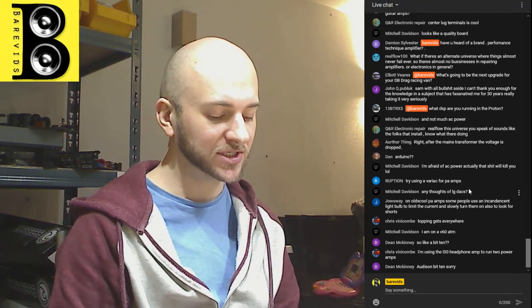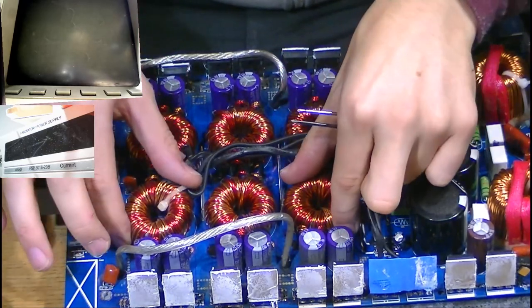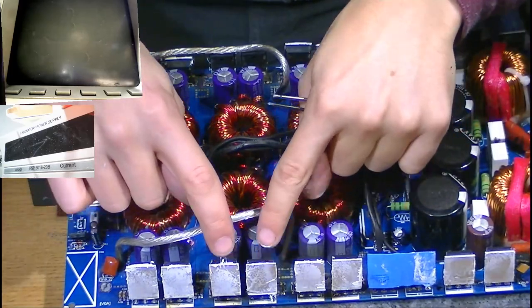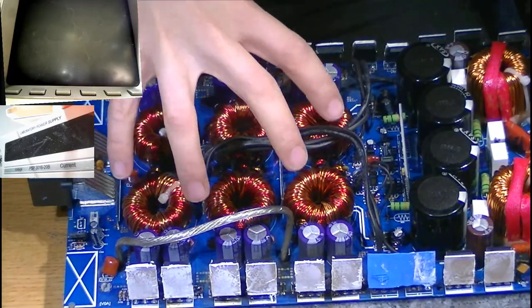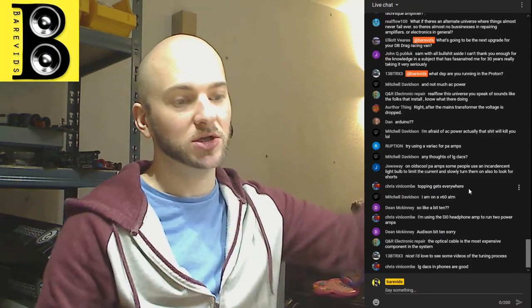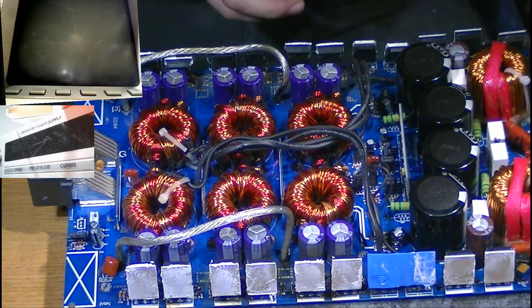It's actually been proven by a few different amplifier design research guys that having multiple smaller transformers, like these baby little transformers, and having only one push-pull MOSFET per transformer seems to be more reliable than having just one huge transformer doing all of it. Sharing the load, multiple men sharing the load, maybe each one has higher headroom, which equates to a much larger headroom if it was spiked. But yeah, it's good to see this used.